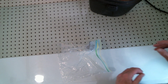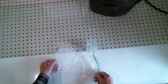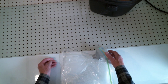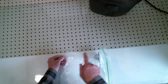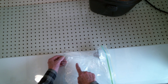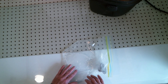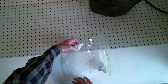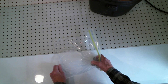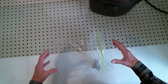After about 10 minutes I've evacuated most of the air. You could see the air bubbles moving towards the vacuum cleaner — it was almost magical, a lot of fun to watch. What we have now is virtually bubble-free silicone, and you'll just need to work it a little bit more, but all without a device you have to construct.